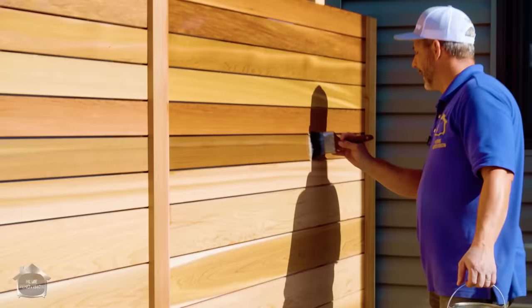Just a quick recap: this fence has five posts set in expansion foam. One day we rented the auger, drilled the holes in a couple of hours, put in the foam, and set the posts. After two or three hours the foam sets and you can start building. I built all of this fence in half a day. The reality is it's a one-day build and another half day to put the stain and lights on — you can do this whole project in two days. If you don't want to use select cedar, you can do pressure treated or knotted cedar and get an amazing look. I'm recommending Osmo Oil from Germany — there's an importer making it available in North America. Check the video description for a great deal.